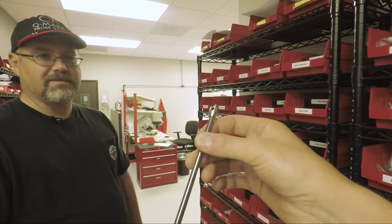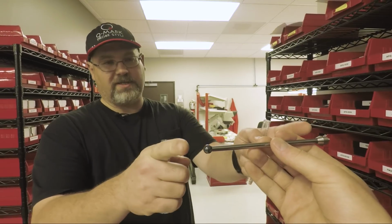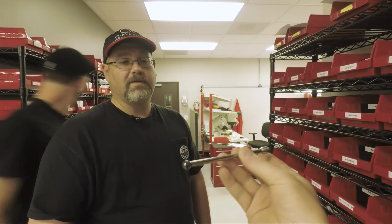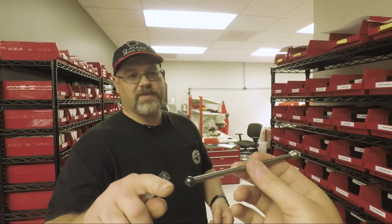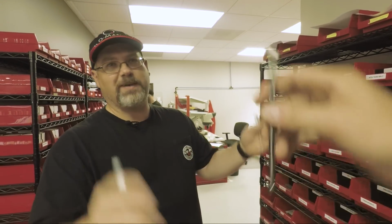The adapter. Why would you use this? It's incredibly heavy. Is it less expensive than the other options? No. It's basically, you need to reach in something deep. You need rigidity. What is the tolerance between the mating surface here and the end of the ball? Is that critical? Lengthwise, we hold it within 5 thou. So that's something the machine just calibrates for. Yeah, that's the beauty of these parts: as long as that ball is spherical, it doesn't really matter where it's at, the computer compensates for it. It knows where in space it is.